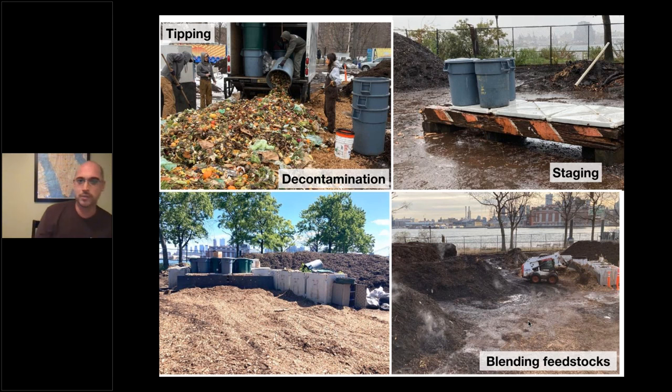This is how we started our days tipping out our trucks. As they got larger, we found a need to stage some of the material. As we scaled up, it became a huge issue to be able to stage the barrels we were collecting and then tip them and aggregate them. We constructed this platform, which also became a mixing bay — that's where we're tipping from, blending feedstocks, and then heaping the material onto our active windrows.